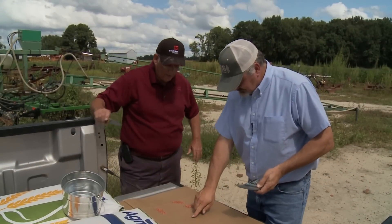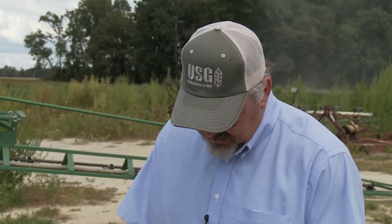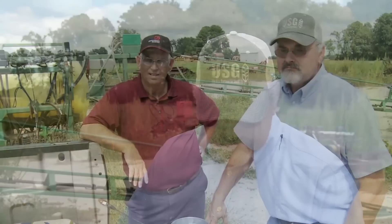The two counters got 310 and 400, for a total of 710 seeds. Five revolutions times 6.66 feet equals 33.3 feet, so 710 divided by 33.3 gives us 21.32 seeds per foot — right on target. Once you've measured your wheel circumference, write that number on the drill somewhere, because it won't change unless you change the wheel size or tires, and you'll always have it available for future calculations.